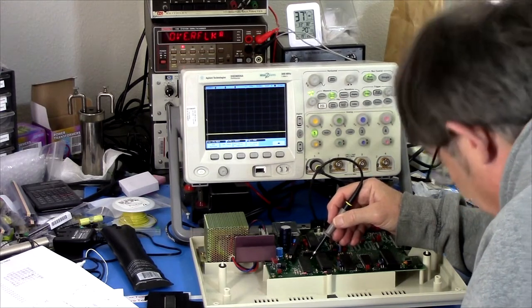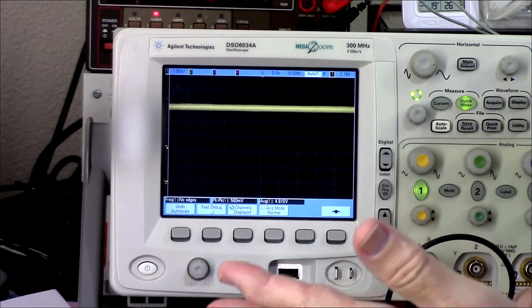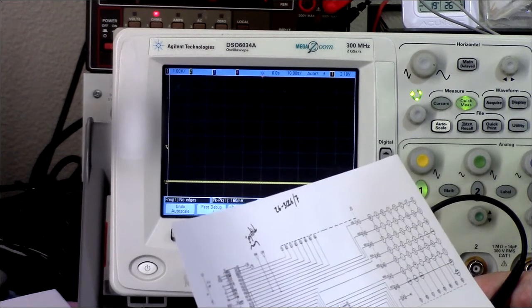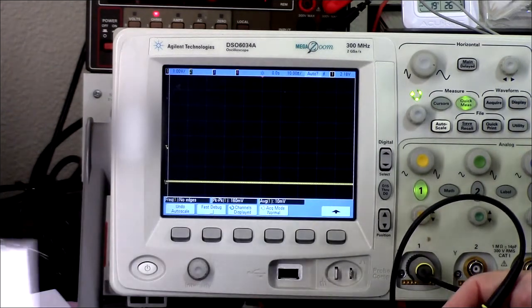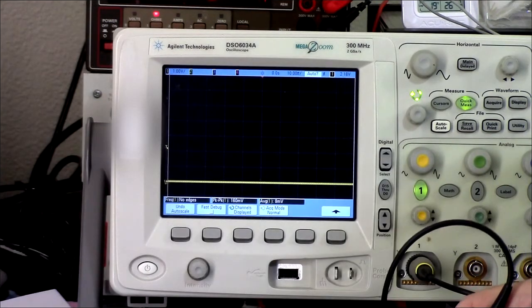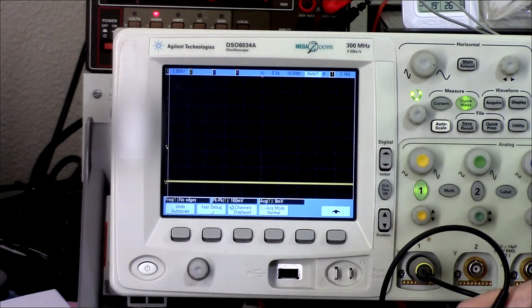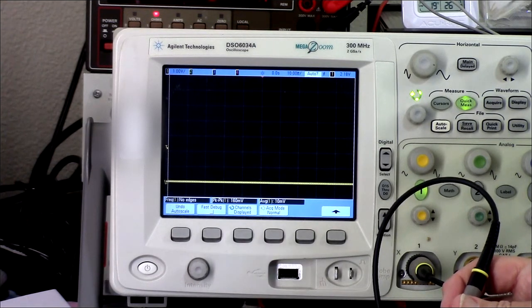That's this guy. Okay, whoops. And that is high. So it looks like it's okay, unless, of course, well, let's check the input side of that. Again, that was pins 18 and 39. Well, the cart is pin 18. Pin 39 is something to do with the cassette. That's high. A little over 3 volts. That's a little iffy. Okay. We should get something closer to 5 volts there.